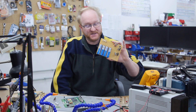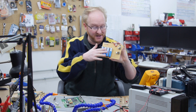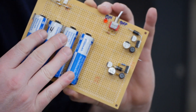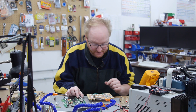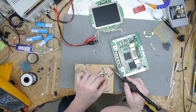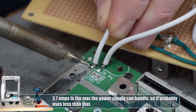Felix rigged up this battery circuit, so we have four LiPo cells — running two in series and the two groups in parallel. That way we have 7.4 volts for the screen, plus enough current to run the system. We knock it down to 3.3 volts and boost it up to 12, and hopefully that'll give us the voltages we need without frying anything. The 12-volt line is 0.8 amps and the 3.3-volt line is 2.7 amps. I'm going to take these wires and go directly into the plug.